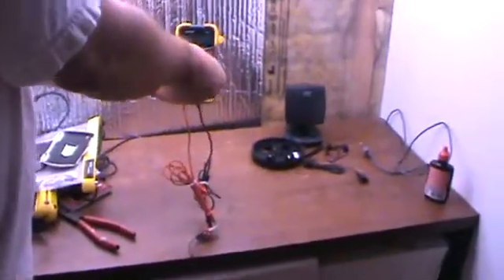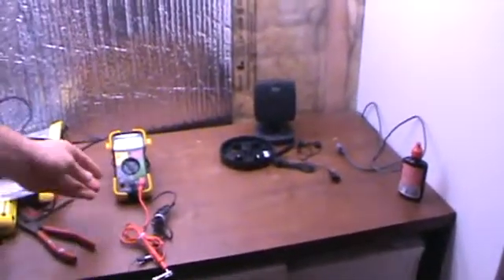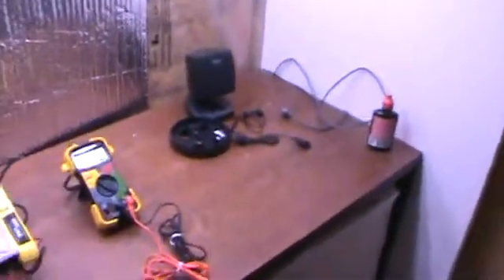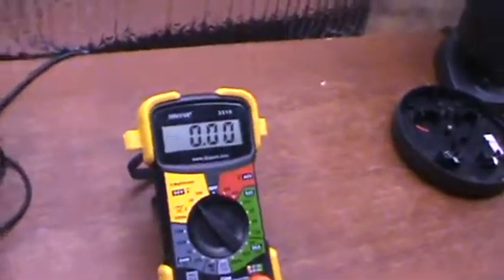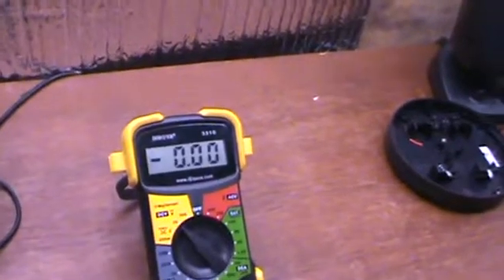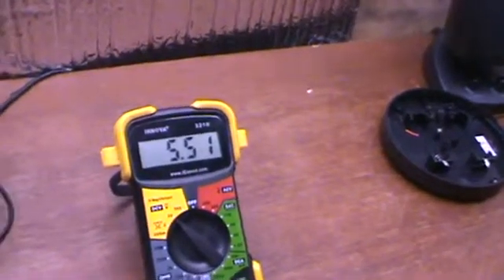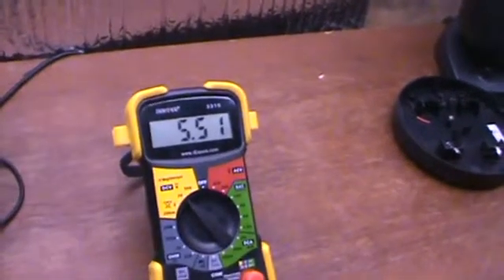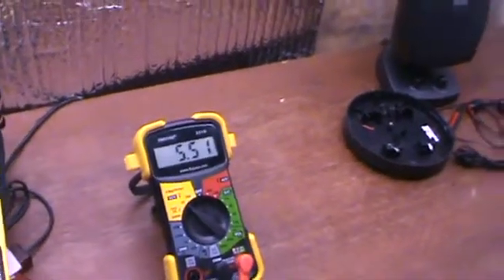When we take a look at the readings we get — let me get to my voltage — and if my cameraman is going to just keep an eye on that, you'll be able to see that at a regular pace, because of the regulator, I'm able to get the desired 5.5 volts. And I'm not overcharging, and if I crank it up even more, it doesn't move. That's the good thing about the voltage regulator.